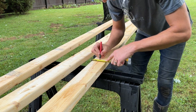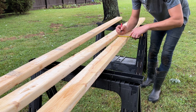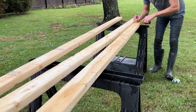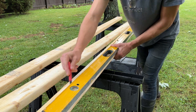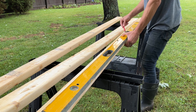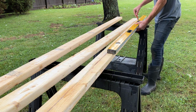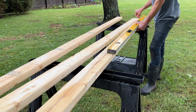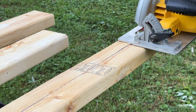This trellis is gonna use regular eight-foot two-by-fours and we're gonna rip them in half. Since a two-by-four is actually three and a half inches wide, we're measuring over an inch and three-quarters to find that center point. Make at least three marks spaced down the board and then using something long and straight, mark a line down the middle. If you don't have anything that long, you can use something shorter and just connect the lines working your way down until you have the center line completely marked, or grab another board that is relatively straight and use that to help mark your center line.